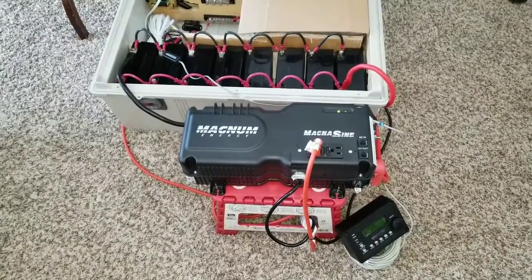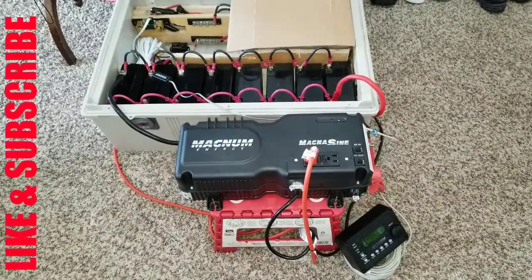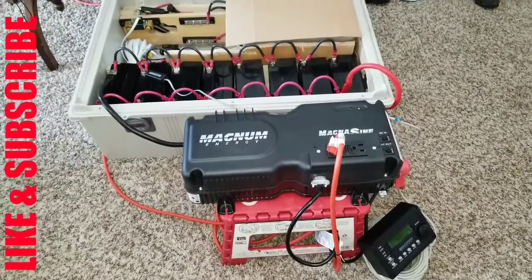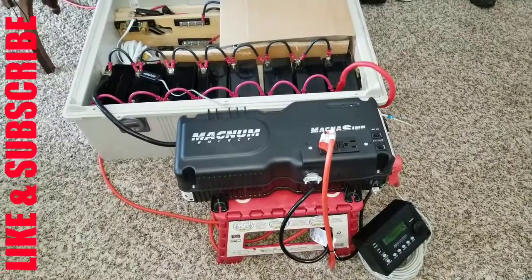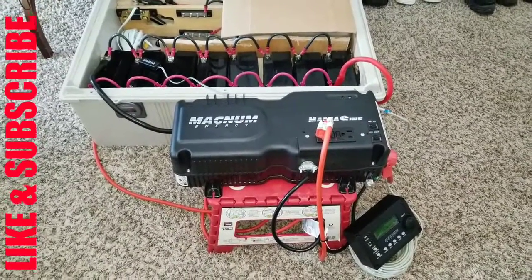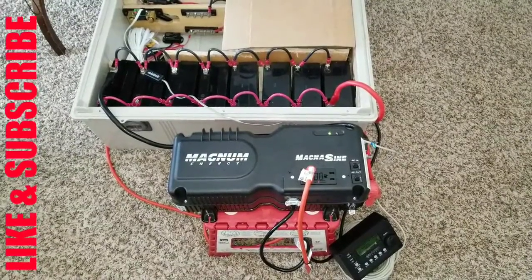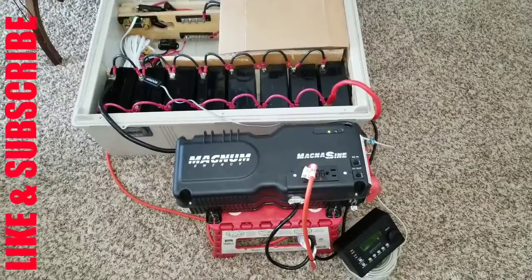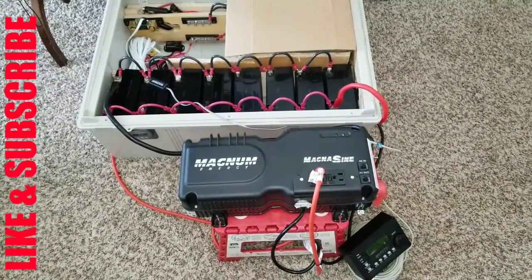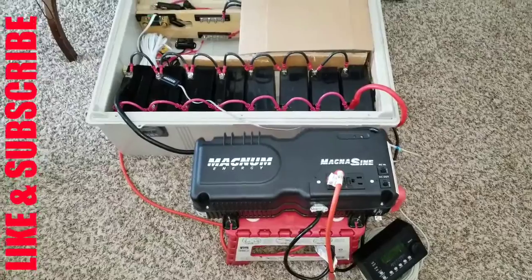14 hours ago I posted a video — if you haven't seen that, I encourage you to go back and look. Live here at JW Solar USA in Minnesota. You guys already saw the unboxing yesterday and the Xantrex charge controller, the 60-150 — 60 amp and 150 volt DC inputs. But today we're going to be talking about the Magnum Energy 1012, which is a 1 kilowatt 12-volt inverter.